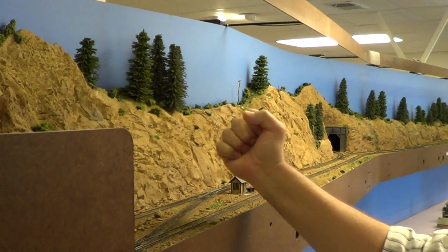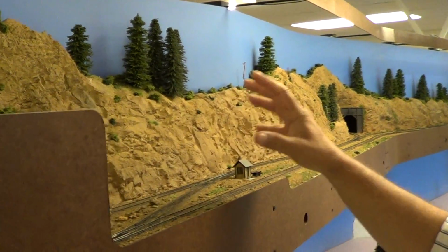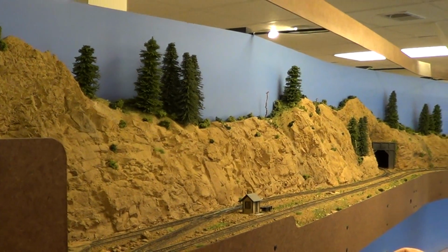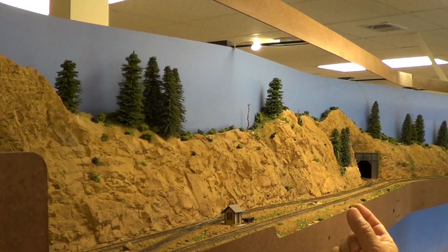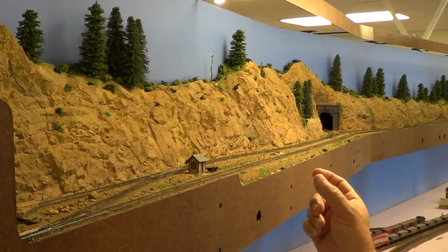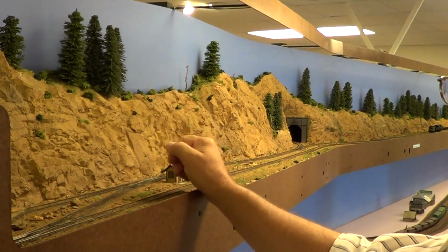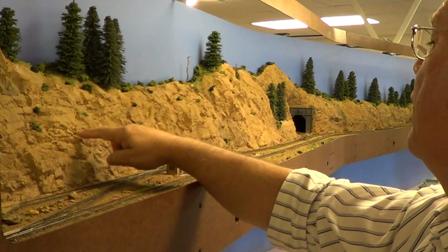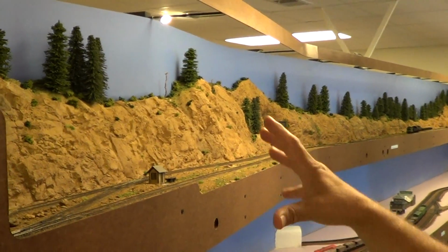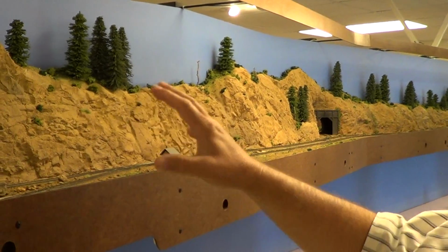As you go, do 6 or 8 inches of crack, then come back, because the plaster's hygroscopic. It's going to start sucking the moisture out of that drywall compound right away. So you want to wet a cheap 1 inch paintbrush with the bristles cut about halfway back, so it's real stiff. Dip it in water, brush it where you've put the drywall compound, and it'll fill in all the cracks and crevices. You stipple and work your way up, 8 inches at a time. And that's what the shell is made of on this side.